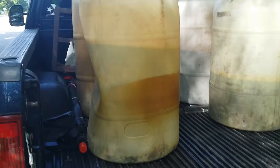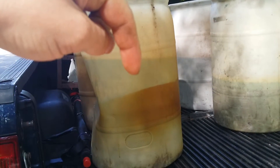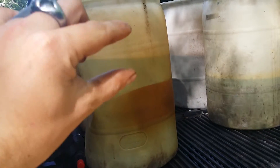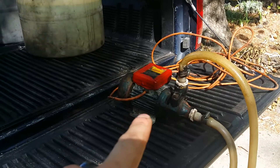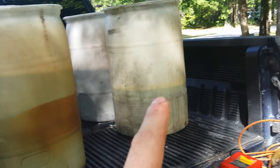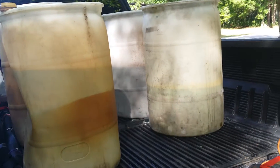So I sized up the check valve alongside these tanks and it's the perfect height — it goes down to about here. What I'm going to do is slide that into the bunghole in the end and reciprocate it until the fluid goes through the check valve and up into the pipe into the impeller. I'm going to pause the video real quick and set this up, then plug it in. The plan is to transfer from this barrel to this barrel as a proof of concept, and if that works, continue to get all of these barrels and fluid off of the truck.